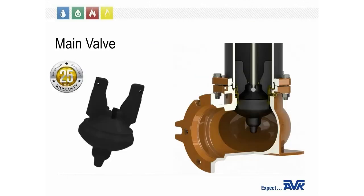Our main valve is a one-piece design with a ductile iron core fully encapsulated in EPDM rubber. These have enough material on the sealing surface that if you do get a rock stuck in the main valve, you can flush the hydrant. Shut off the isolation valve, reopen the hydrant, and let it sit. Depending on the temperature, this may take five minutes or a couple of hours. If the rock flushed out and the rubber was not damaged, it can reform to its original shape and seal off. If it won't seal off, we recommend replacing the main valve. The AVK Series 27 one-piece main valve comes with a 25-year warranty.